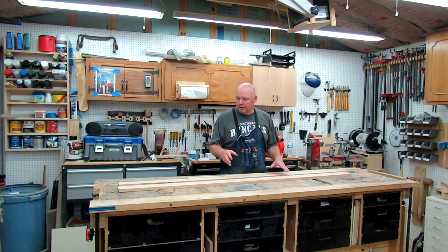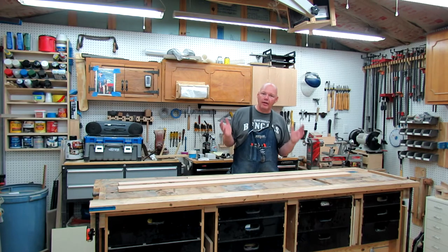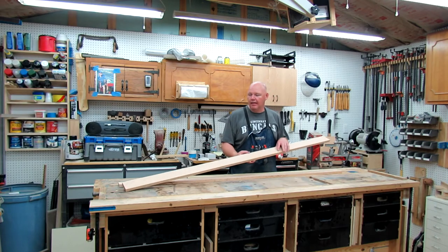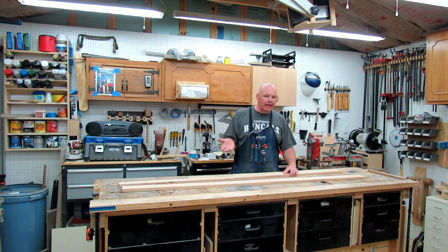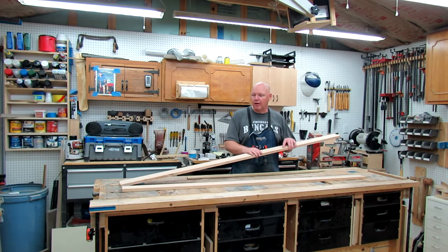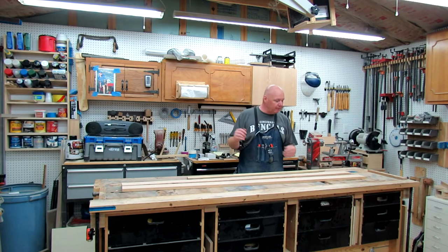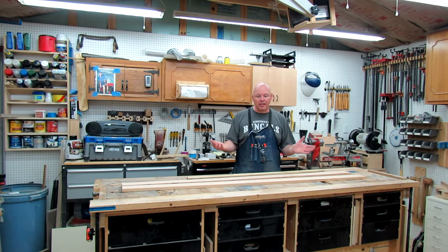To get started, the first thing we're going to need is some wood. I had one board and I ripped it down off camera just to speed this video up a little bit. I ripped mine down to 3 and 3/8 inches wide. The home center sells it at 3 and 1/2 inches wide, which is perfectly fine as well — that was just the max yield I could get from my board. If you're going to make the same project, you're going to need your board 75 inches long. If you're just making it for a couple of mats, just adjust it for yourself.